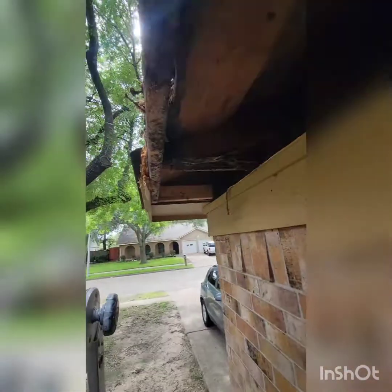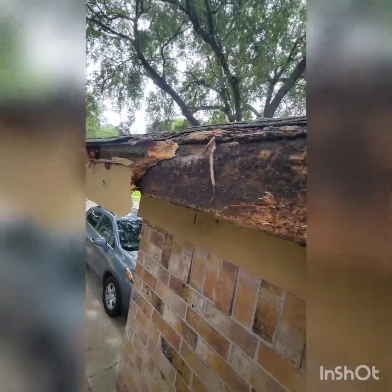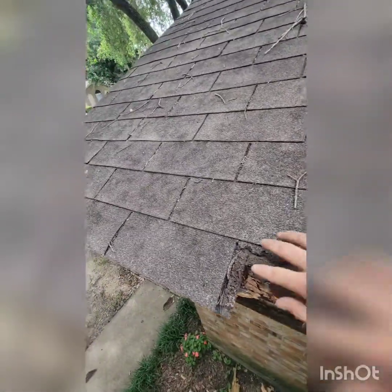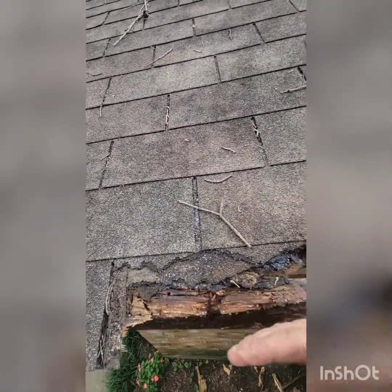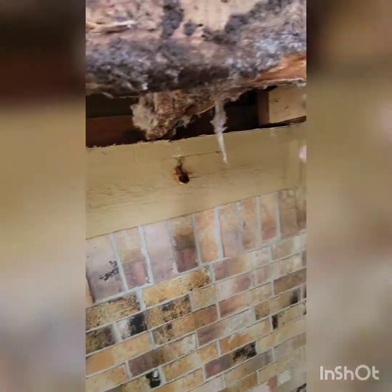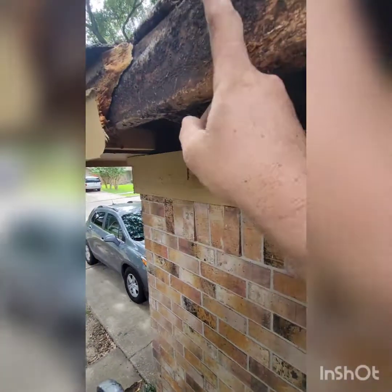The third and final spot to patch on the roof is where it's leaking into the soffit. I had to pull the soffit down and you can see all the two-by-fours are rotted. I'll find where the stair-step pattern is — it'll probably go up to here. I'll replace the decking if needed, then rebuild all the framing with new two-by-fours, new soffit, and new fascia.